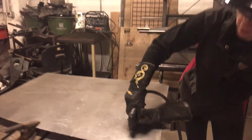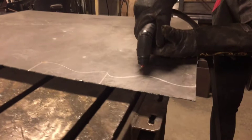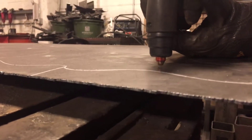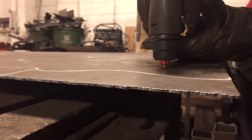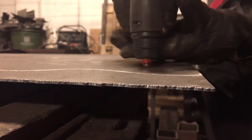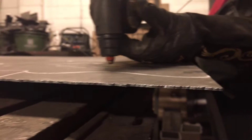When you are cutting, you want to hover about a sixteenth of an inch or less above the work piece. You don't want to drag it because as the material is melting it's creating slag, and it's also going to keep you from making smooth cuts as it's bubbling up. So always hover.